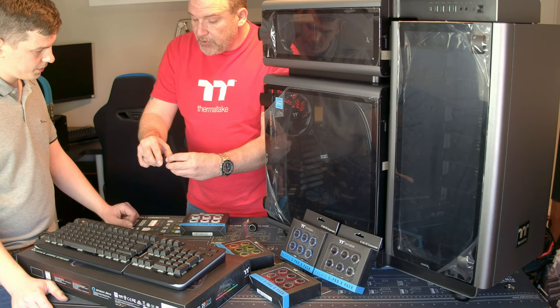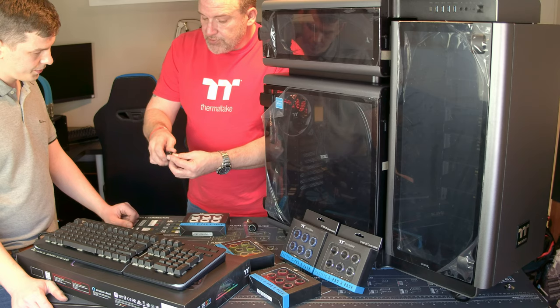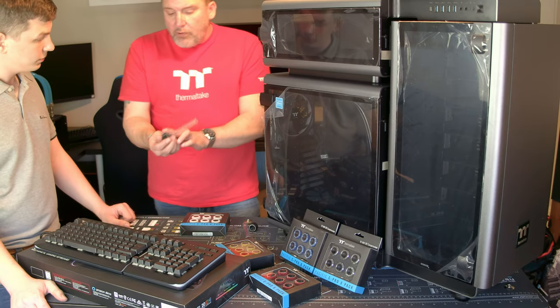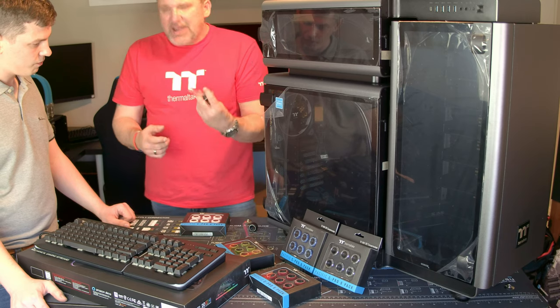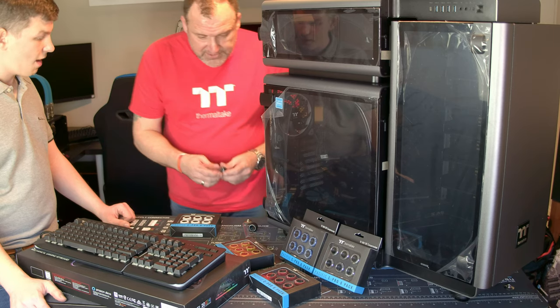So once it's nicely and perfectly aligned and flush with the bottom of the collar against the O-ring, it just goes straight on. So it's not much more complicated than fitting the old-fashioned soft tube. But we've got four O-rings in this, so it's that added security from leaks. I've been using these since they brought them out, and I've never had a leak with a C Pro fitting.